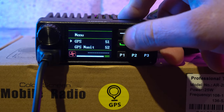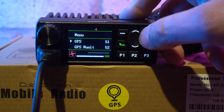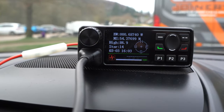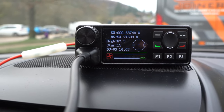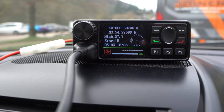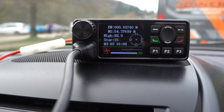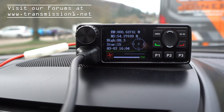The model I have here has the GPS function enabled. I went into the options, turned on GPS, and after a few minutes managed to get a lock onto the GPS satellite signal and basic coordinates were displayed. The unit can transmit positioning information to other similar radios nearby and show distance and bearing between the two units, but don't get too excited — this isn't an APRS setup like Kenwood, ICOM or Yaesu. It appears to be a basic GPS coordinate system, though another YouTuber managed to get raw GPS coordinate data output through a terminal session usable with third party software.